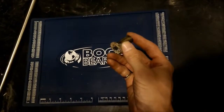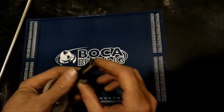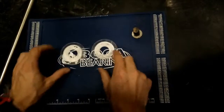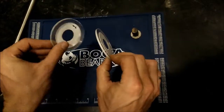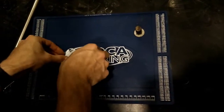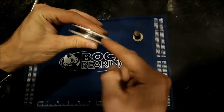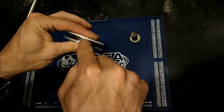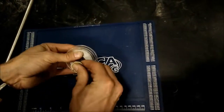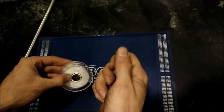Alright, so we've welded together our very own shaft cotter pin. It's got the washer on one side to stop it from coming out of the pulley, and then we can put a real cotter pin in the other side. And then we have our two recessed washers that we made using the laser cutter. As you can see, the ball bearing fits inside and it actually overlaps the edge, so now if the Kevlar rope comes up onto that, it won't slide off and land on the shaft — it'll land on the washer instead. We need to sand that down a bit more.